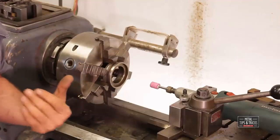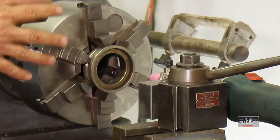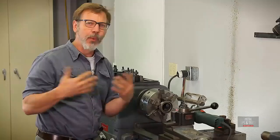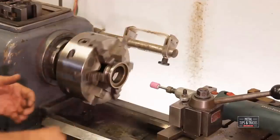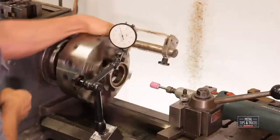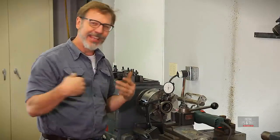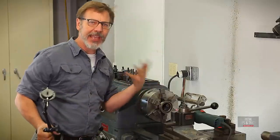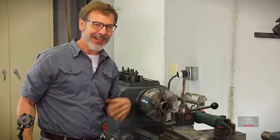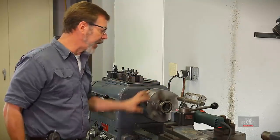Other people also ask: since I've got an adjustable back on this and I can actually change the concentricity of this chuck and get the part lined up, why don't I do that? There's really a good reason. This chuck is out about 15 thousandths, which is way, way out — definitely needs to be reground. But I could change the back and make it work that way. The problem is it shifts so much of the chuck that the lathe is no longer in balance.